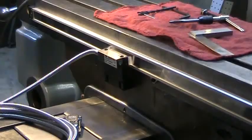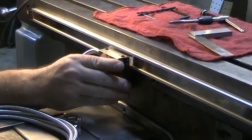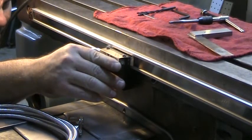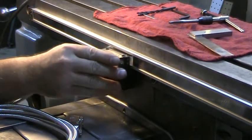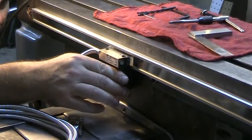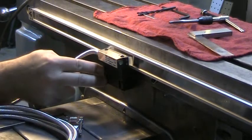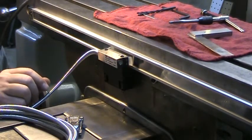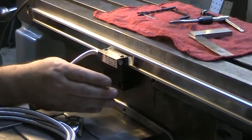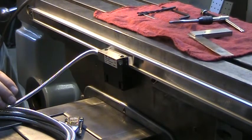We're ready to find out where we need to place the reader head. There are specific tolerances that this reader head needs to be set for. The simple attachment has really nice slots that give me a lot of flexibility for moving the reader head up and down, and there are also two sets of grub screws — basically set screws — on either side where I can adjust for rocker back and forth and tilt up and down.